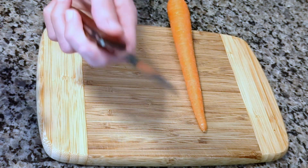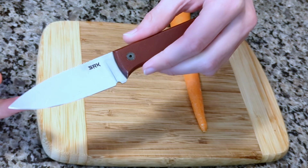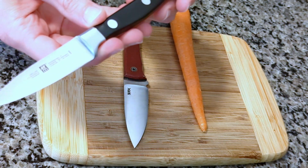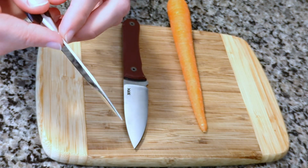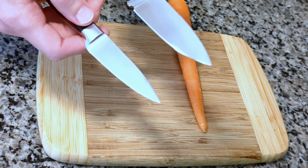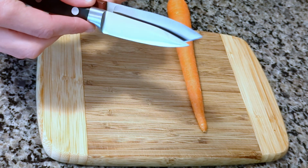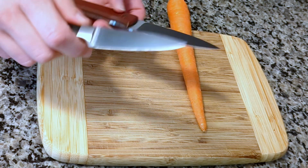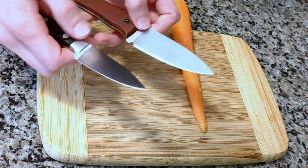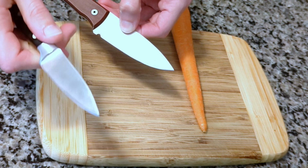And these are actually really comparable grinds. So the blade stock on this is 96 thousandths, just under 0.1 inches. The blade stock on this is much, much thinner. This is 65 thousandths, but the reality is this is a much shorter grind. And these both come to about the same 15, 16 thousandths behind the edge. And so if you actually measure how thick this blade is at the height of this grind, it's 75 thousandths there. This is 65 thousandths.